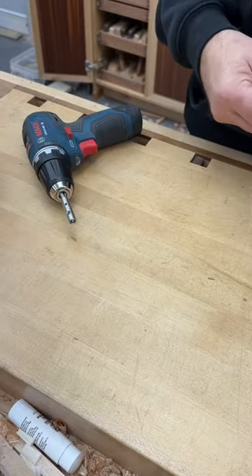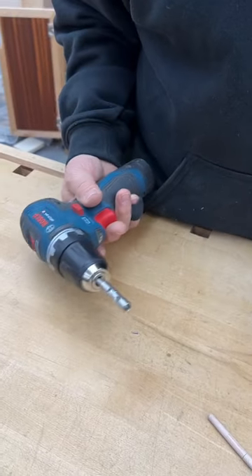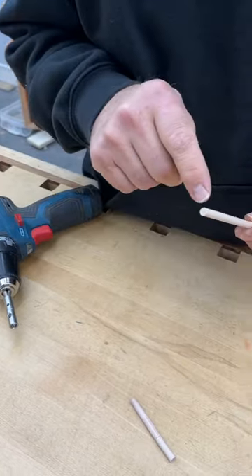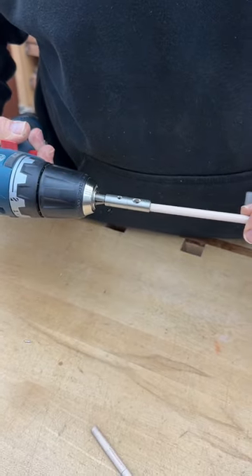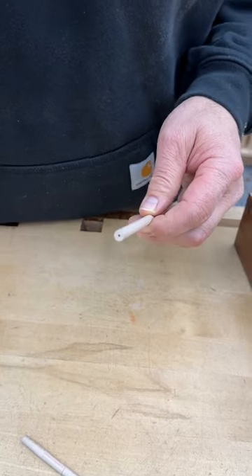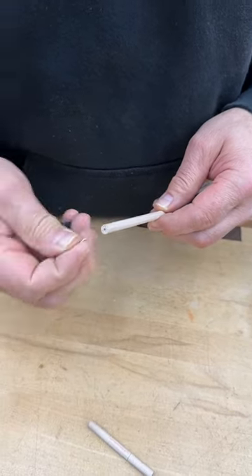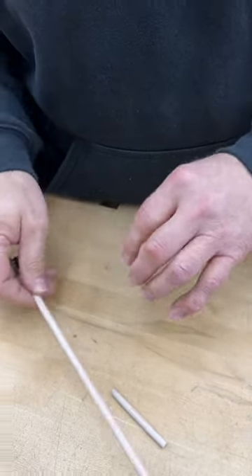The secret to it is a little jig that I developed a long time ago — we actually sell them on our website — that drills a perfectly centered 1/16-inch diameter hole in the end of your dowel. You simply spin it and as you push it in, it gives you that perfectly centered hole. We use 1/16-inch rod to connect the two pieces together, and that makes your hinge.